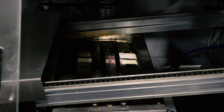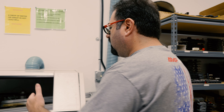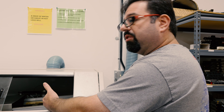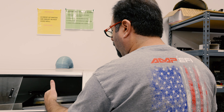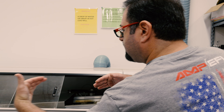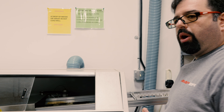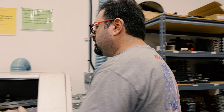In just a second, we'll turn the machine on and the molten solder will come out and make a wave — like a wave machine at a resort or cruise ship, but it's molten solder. We pump the solder over the lip to make the wave, and the bottom of our PCB skims the very top of that wave, instantly soldering all the components to the PCB.